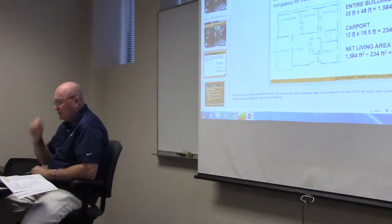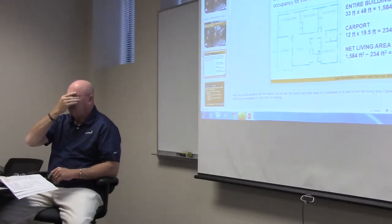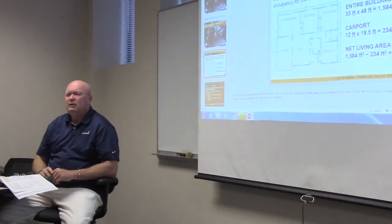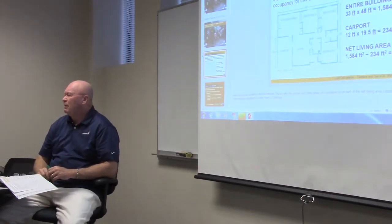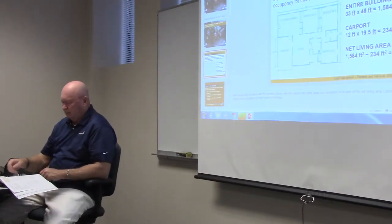Generally speaking, around here, usually on a 480, a 65K panel is sufficient. And on a 120/208, somewhere around 22 is sufficient. Most of the time, even down around 10. But you better check.